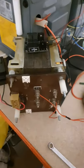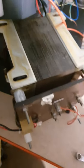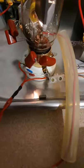For the filament, I'm using a variac-controlled transformer — that's just a ZVS that I'm playing with — and this goes straight into the filament. It's directly heated, so the cathode is also grounded through these copper wires.